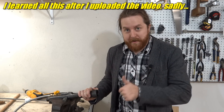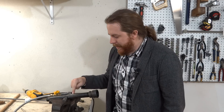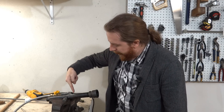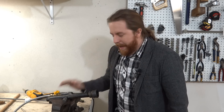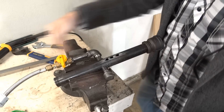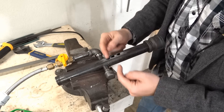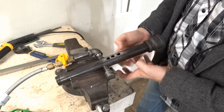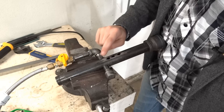We're supposed to get a big blue flame, but it was burning inside — the fire was starting back here — and you could even see that in the video. This part was getting pretty hot, making all kinds of racket, and you couldn't get the nice defined cone shapes. The propane goes through here, through a hole drilled in this pipe pointed right down, it passes by these holes, sucks air in through them, mixes in the tube, and is supposed to burn out at the end.